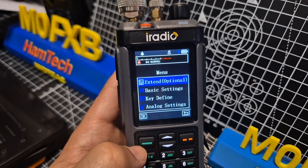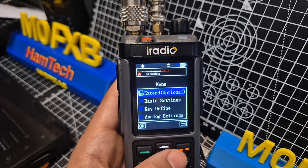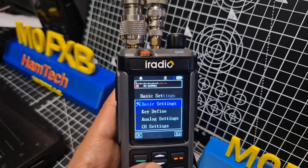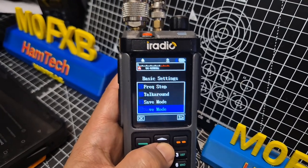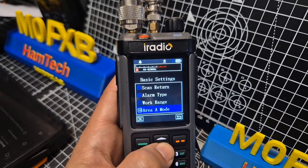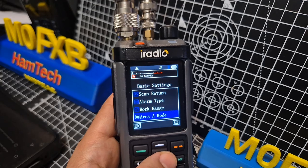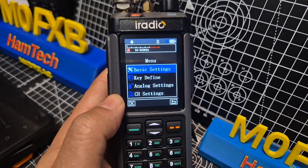The other one — you've got multi-receive. You go to the menu, extended functionality, then into basic setting. If you go to about item 17 — work range, you don't need anymore. You can have multi-PTT, so all three buttons work as a PTT. And then you can have multi-receive mode as well. Bye for now, 73 — Bluetooth!